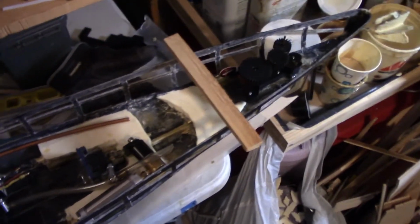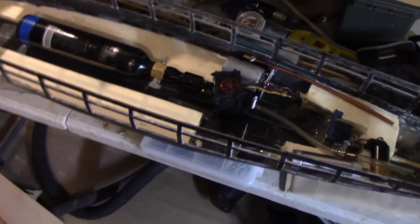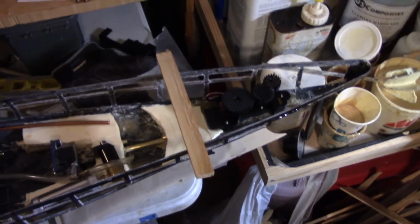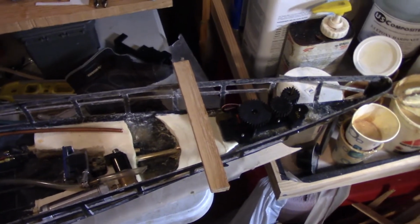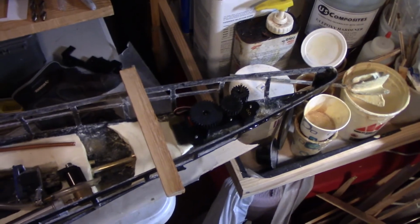Okay, so now that I finally have a plan, I'll go about lining up and getting the pieces of wood selected. I've built a lot of boats, so I have a lot of scrap pieces of wood, so find the smallest piece that will fit the application. I'll trace out one piece for the aft portion, and then use probably a full piece or a near full piece for the bow portion, and I'll do the subdeck first and get that figured out. Once I have the subdeck all cut out, I will use that as a template for tracing out the deck rim piece. It makes it a lot easier.